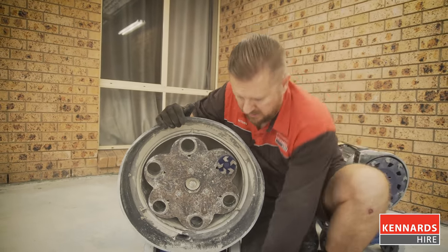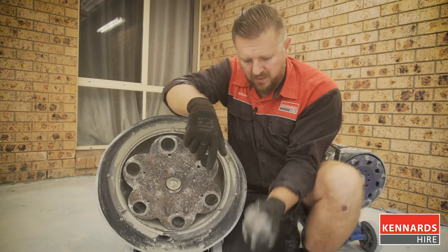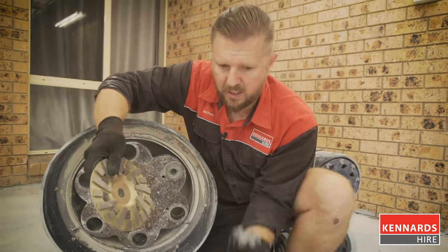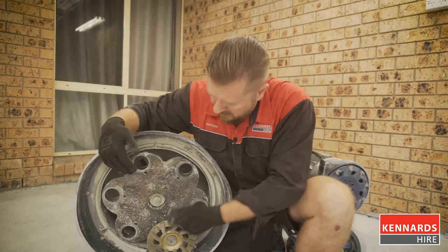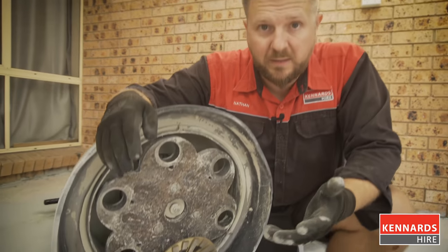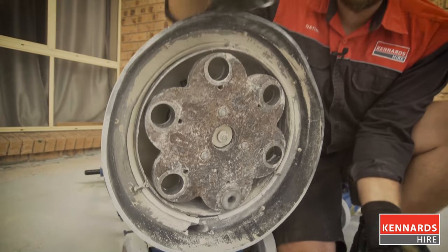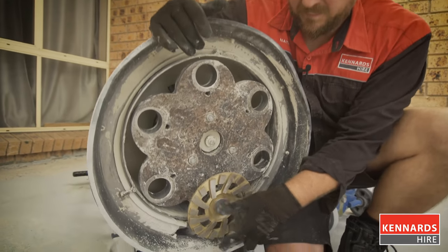When you're changing from plugs to discs, the plug comes out. For the discs, you've got your magnetic plug which goes back in. Then you've got your disc and your insert — insert through the disc, into the plug, three ways around the plate. When you're going through your process from more aggressive discs through to finer grades, just hands either side, out comes the insert, change over to your new disc, insert back in, and away you go.